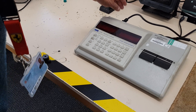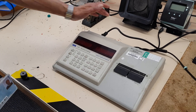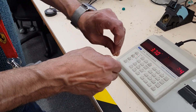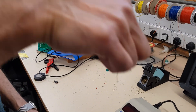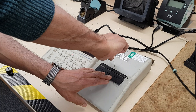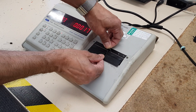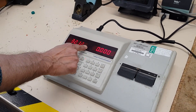This is the demonstration for the LCR precision bridge. Switch it on at the back and you can measure any resistor like this. You just hold it, fold the legs like that, bend the tabs back on here to get a good grip, and then rub it up and down to get a good connection. That's 32.1 ohms.